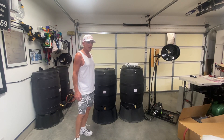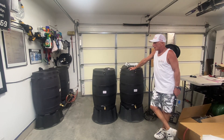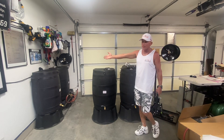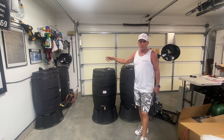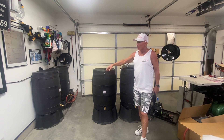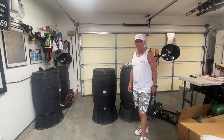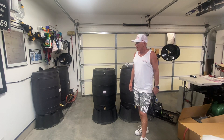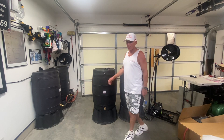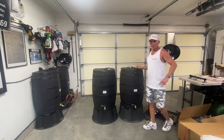The high pressure hose I use is some serious army-grade stuff — absolutely bulletproof. If you're not going to use all the water, the system produces 100 gallons a day, so both tanks fill in just under 24 hours. Sometimes my tanks last one or two weeks, so I just turn off the water feed so I don't have reject water going out unnecessarily. When they get halfway down I'll flip it on, and 12 hours later I come out and turn it off.